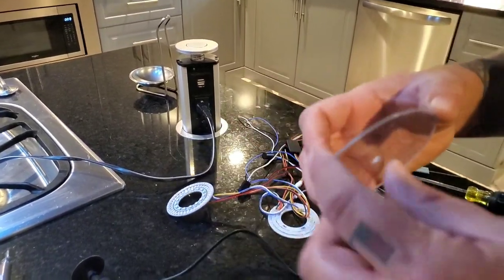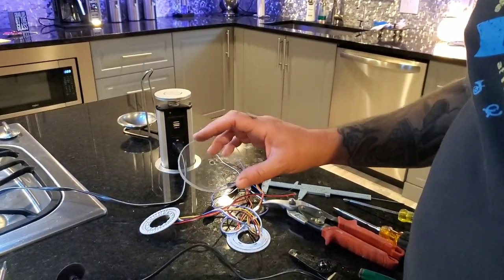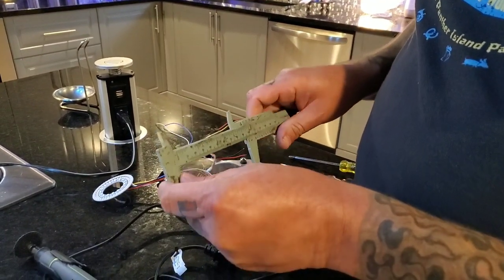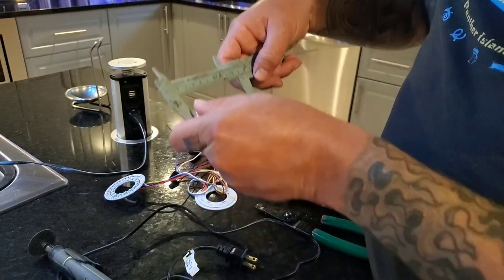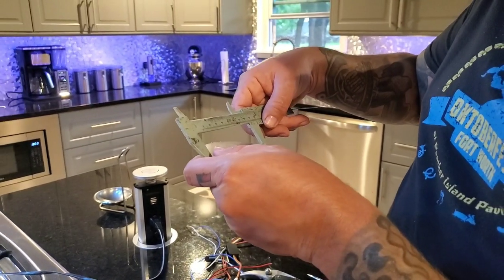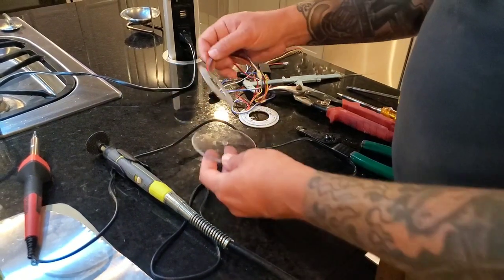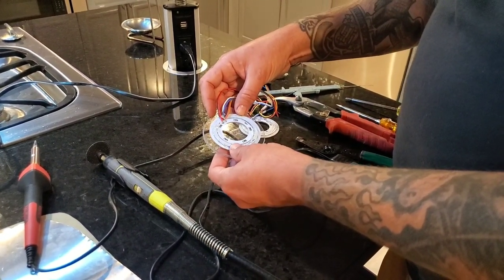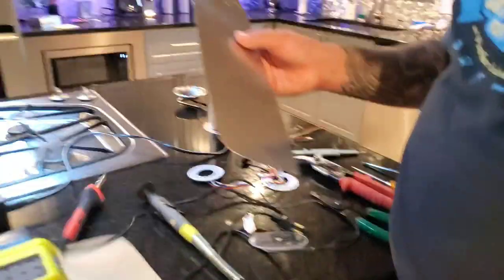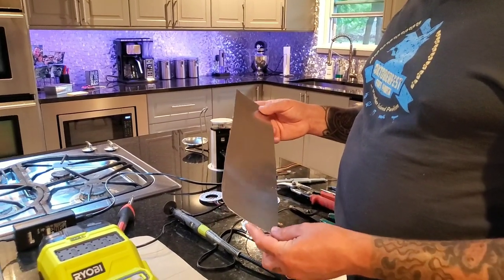You're also going to need some plexiglass — pretty thin plexiglass. You can get a big sheet at Home Depot or Lowe's for probably about $15. There's a drill bit that cuts about 85 millimeters or a three and a half inch circle, and that's what you're going to glue this to. I hot glued it and then put some silicone — the hot glue will hold it and then the silicone will keep it in place permanently. You're also going to need some sheet aluminum, doesn't have to be very thick. You can get a pretty good size sheet, maybe three foot by three foot, for about $15 to $20.